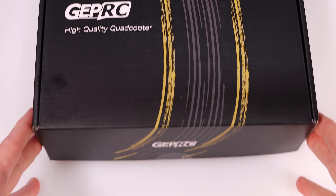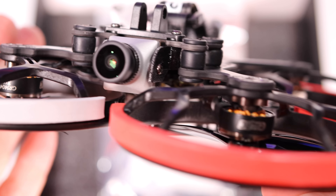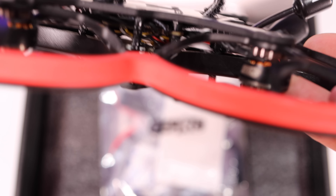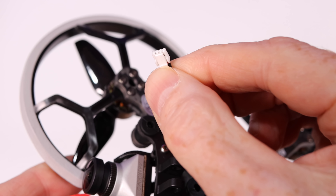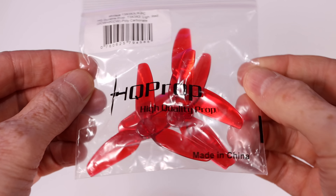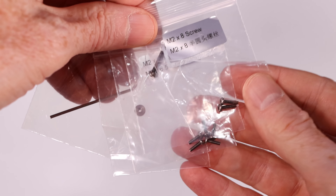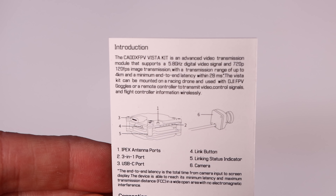So you're interested in this drone and probably want to know what comes in the box — here's what comes in it. The drone is made out of carbon fiber and plastic. Up front, the camera is the Caddx Polar Vista on a nice dampening system, so no jello. The brushless motors are 3850 kV. On the bottom, the Caddx Vista system is covered by a carbon fiber plate, and you can see the F4 flight controller. There's the Polar antenna that goes with the Vista unit. Additional batteries must have an XT30 connector. A cable lead is provided to power an external camera, and total weight without a battery is 158 grams. Inside the box you'll also find spare props, spare propeller guards, bumpers, a battery strap, a skid plate, a camera protector, a pile of screws, a crossfire antenna attachment, a battery grip plate, instructions for the Polar Vista, and GEPRC stickers.